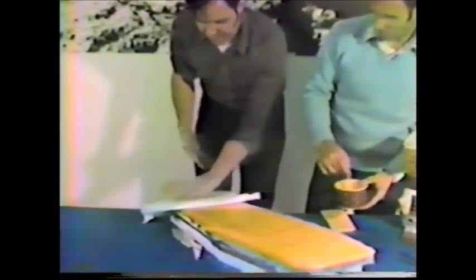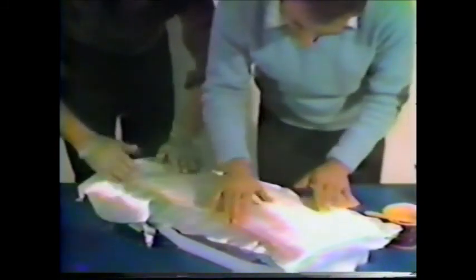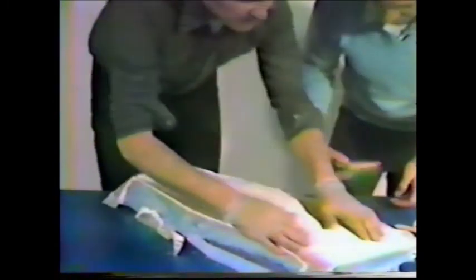Scissor-trim the ply back a quarter inch away from the edge. There's another ply going on, so it's okay to leave it excessively wet — in fact it's better to have it wet so epoxy soaks up through the second ply rather than having it dry with air coming back up. In a little curved area like the trailing edge, it's fine to have a little excess epoxy. It's okay to leave extra cloth on areas that hang straight down — the weight helps keep the glass against the surface. Now we're putting on the second ply, with fiber orientation at 30 degrees crossing the first ply, so the relative angle is 60 degrees to each other. The second ply is always much easier than the first — easier to go over fiberglass than foam, so it wets out quicker.